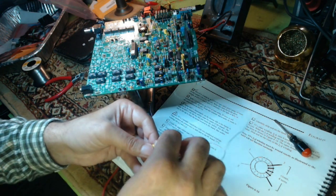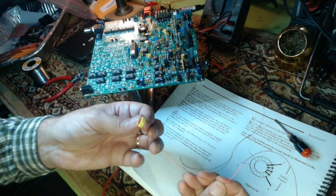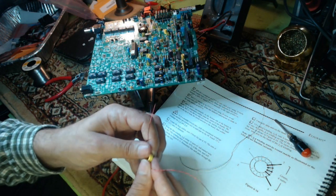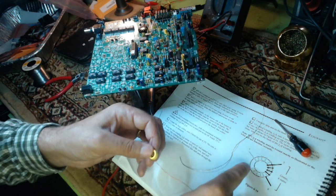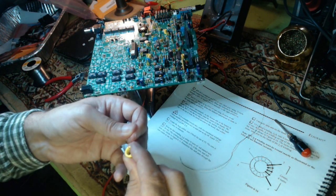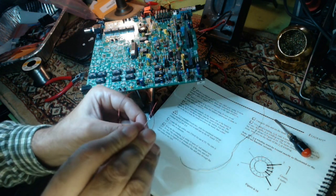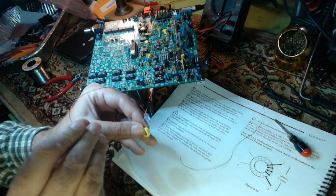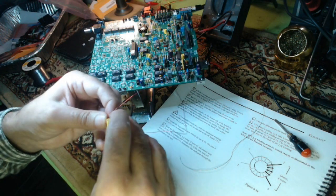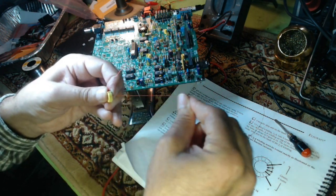So we want to look at this picture and make sure my first winding going in this direction is coming out the top to ultimately be soldered down. So that's number 1, pass through 1. This is number 2, and I'm going to count them all the way around. Very boring, as I said, I know, but I want to at least have one winding of a toroid on camera.